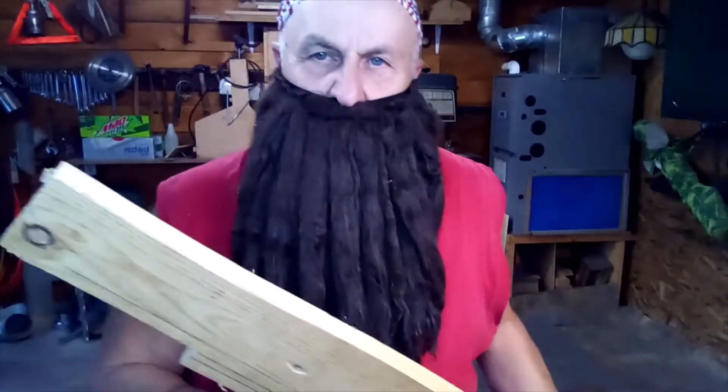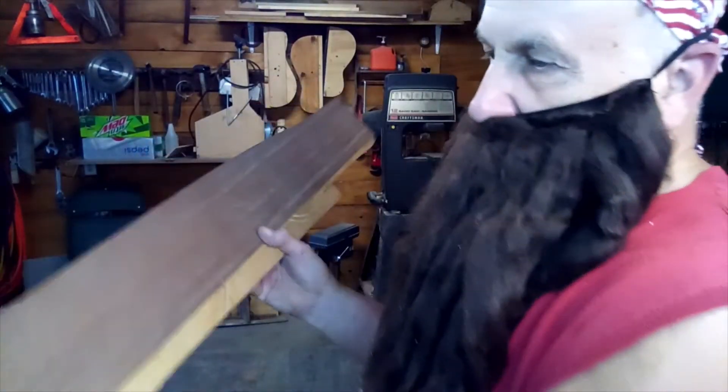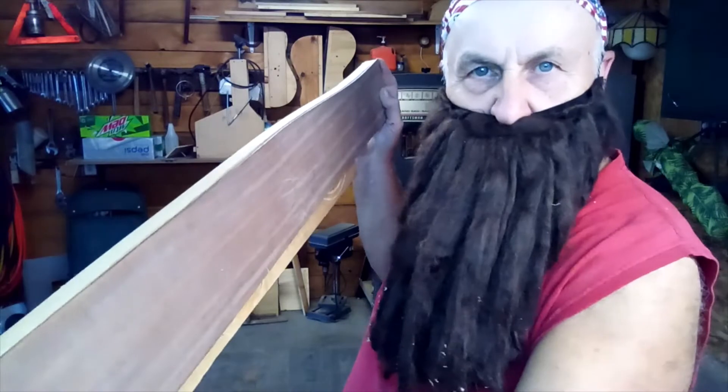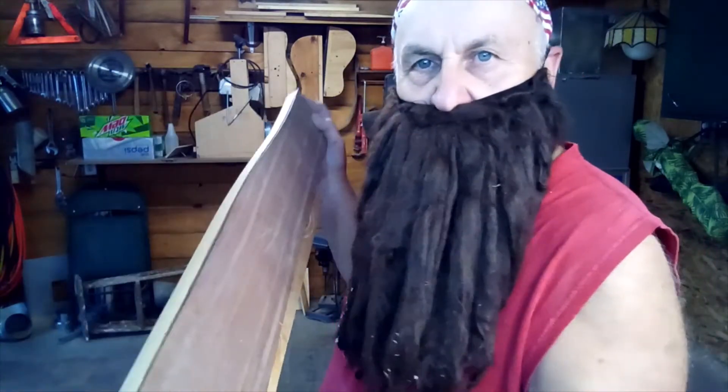Basically the same thing I did with this board here, which is for the sides. They're not just the same from one end to the other, so I radius this board by using an already-done Martin piece of stock. I put this board on here like so, take a flush bit router — just a regular old router — clamp this down, take it and run it across there: perfect stock every time. If your pattern is right — you know what they say, practice doesn't make perfect, practice makes habits, so you've got to be perfect to make it perfect. And with that said, it's close enough.